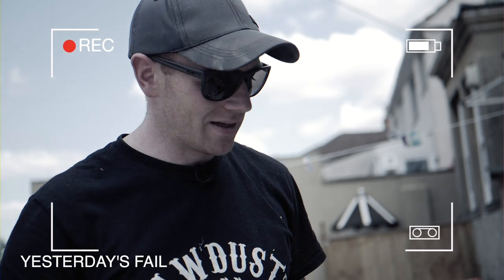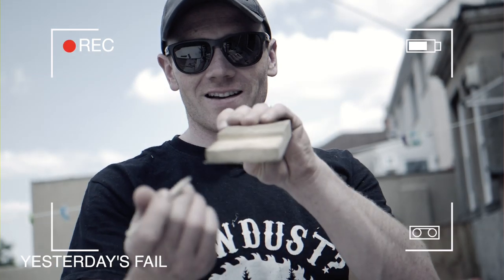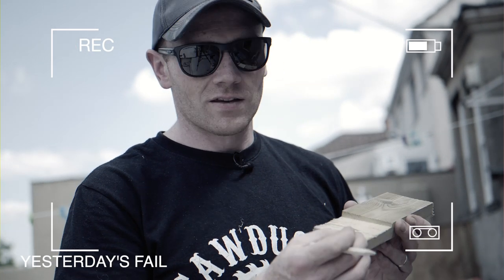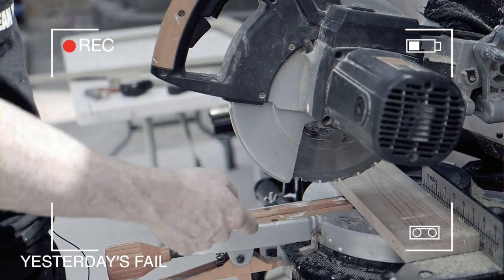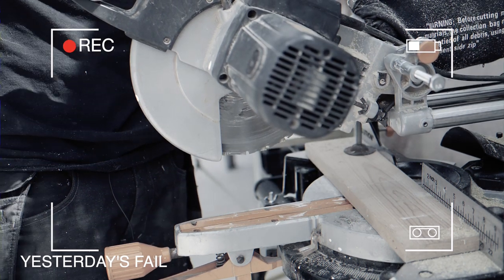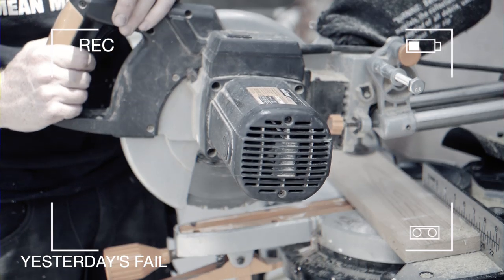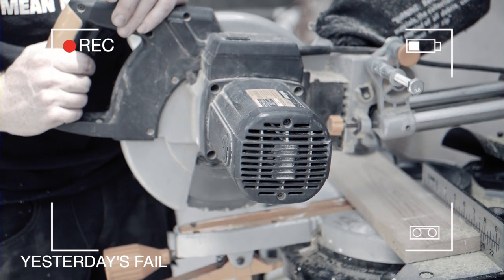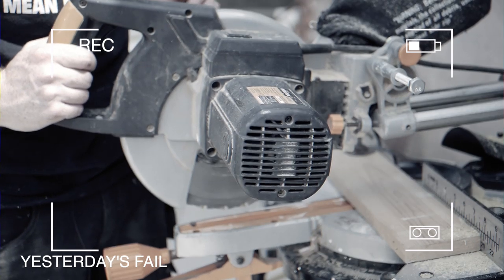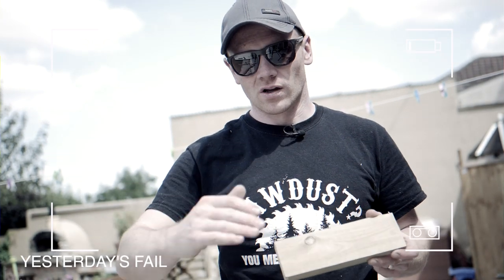Now I'm going to have a complete change of heart, a complete change of plan, because this is real life. This saw is doing a terrible job at these half laps - you can see here it's just not a flat cut all the way across. We're nicely halfway down on one side but the other side is a completely different story. The problem is that this particular budget saw, at full extension on its riding bars, has a bit of play. On something that's less than an inch thick, that play is huge - it's 50% more cutting depth. On a table saw with a sled it would be a lot more even.